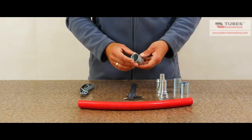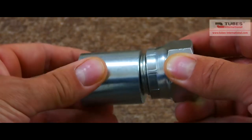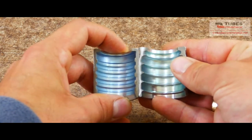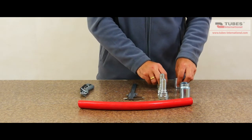After the fitting is selected, we have to match it with the right ferrule. The ferrule I have chosen is made by machining and has a collar at the front, mating the lock of the hose's edge. On the inner side there are properly shaped corrugations that compress the hose but do not cut it. For this video I'm going to use the TAIL ferrule according to the Tubes catalog.